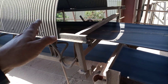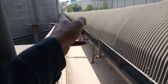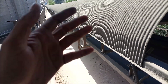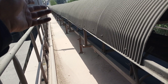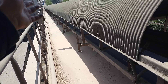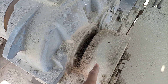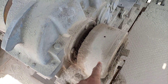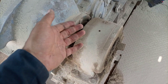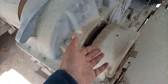When the belt backs up, the material on the belt will pile into a large heap at the end. This becomes a problem when we try to restart the belt, because the large heap of material sitting on the belt prevents it from starting. It is also a problem for cleaning. That's why this particular equipment — a mechanical backstop — is installed. It is a one-direction bearing: in one direction it runs freely, and in the other direction it stops and acts as a brake.